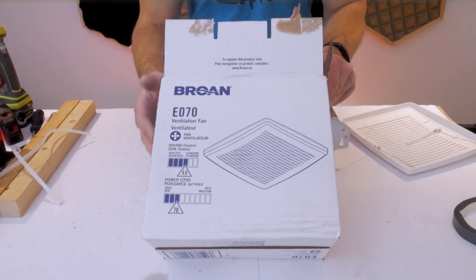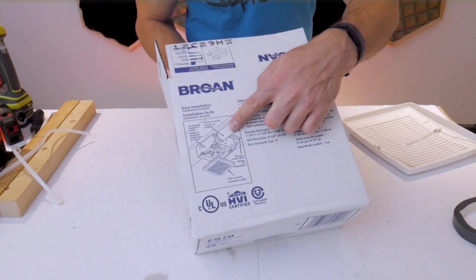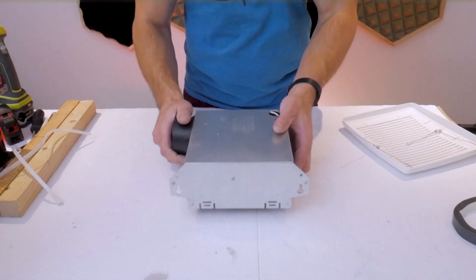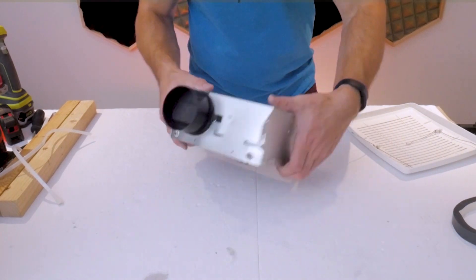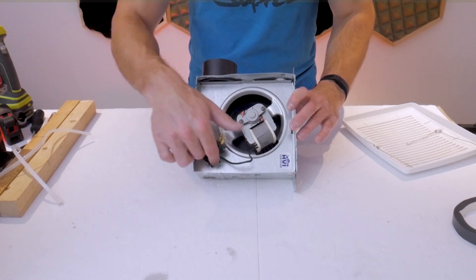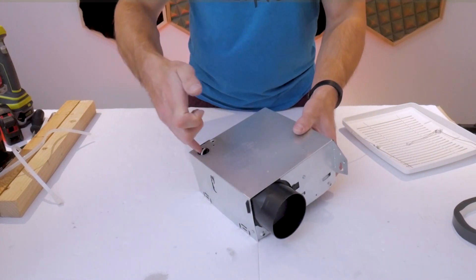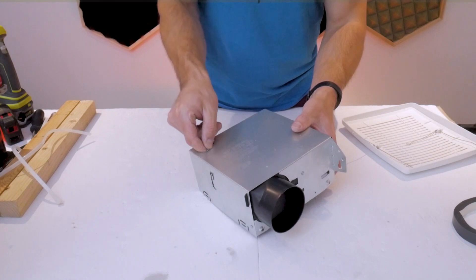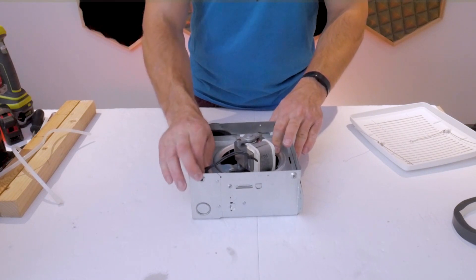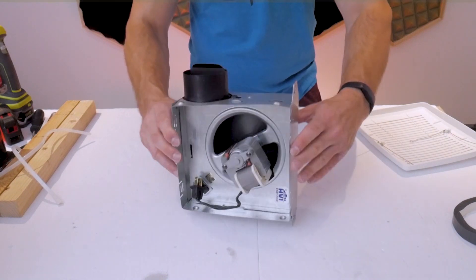With the window panel complete, let's look at the fan we're going to be using — a pretty standard economy bathroom fan. It's a 70 cubic foot per minute fan, which is not a lot and definitely won't clear out an entire room, but it's intended for something small like a bathroom. I'm going to place this right on top of my printer, hoping that the very close proximity will help evacuate those fumes. The unit has an outlet plug on top, but there are also wires to hardwire it into a regular bathroom installation. Conveniently, because of that connector, I can just plug in an extension cord.